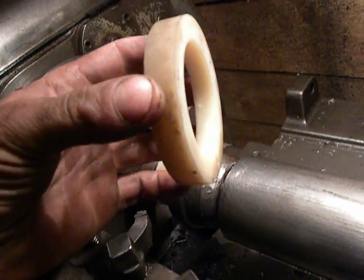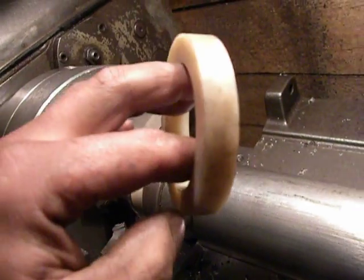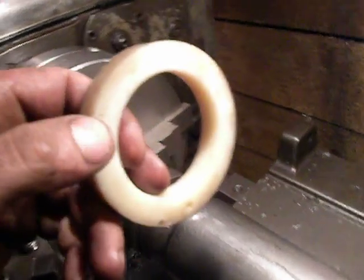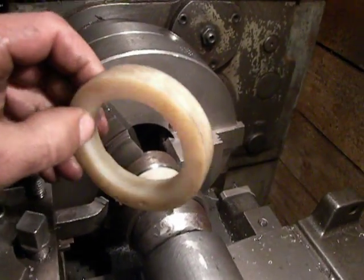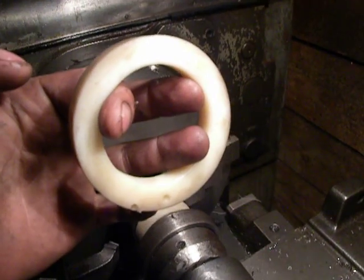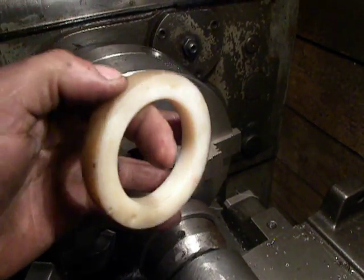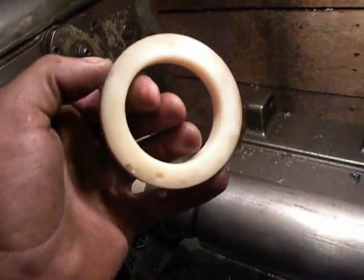I have no place where I can hold this piece in the lathe jaws. Also if I take it on the jaws like so, then the job will come out triangular, and that is wrong.